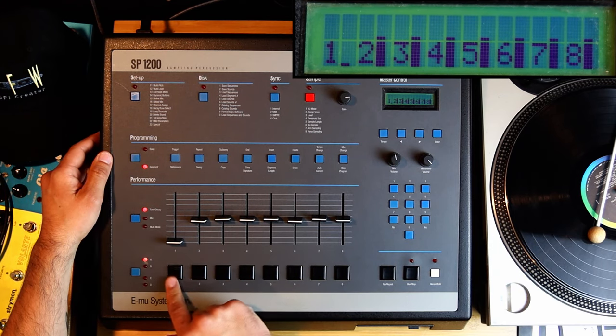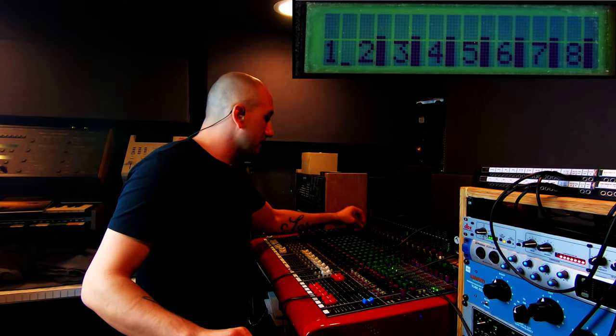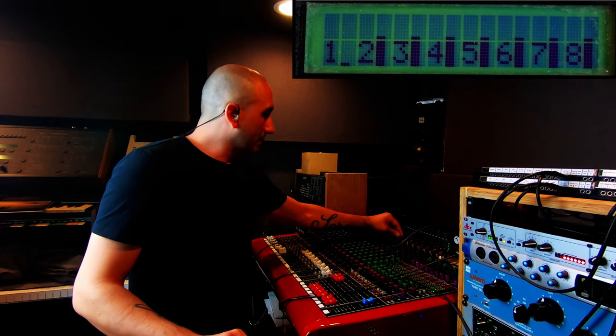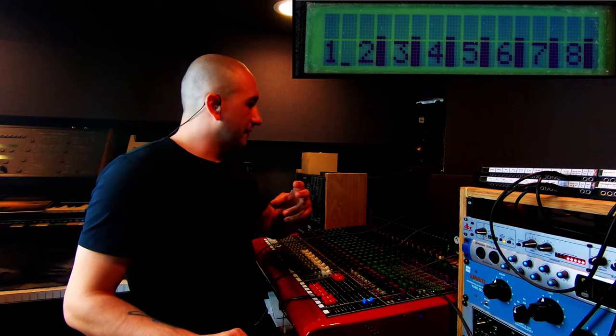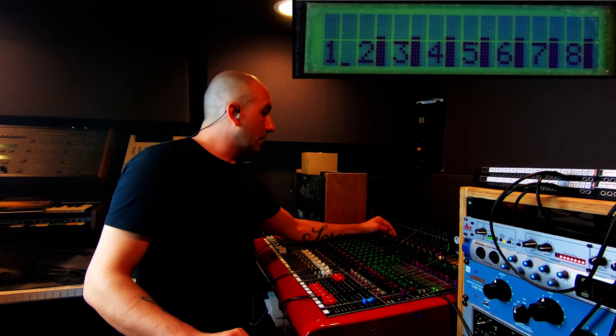See what happens? That's crazy. The kick is actually on channel nine. I'm making it saturate the channel a little bit so it's a little bit in the red — I don't mind on the analog console. Now I'm gonna turn on my EQ. I want to make you really hear that crunchiness. If I go into EQ and increase the high frequency — the treble — listen, it's gonna get crunchier and crunchier. You hear that? Clack, clack, clack.